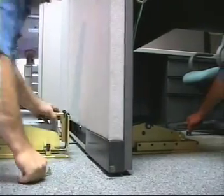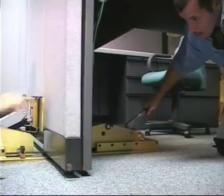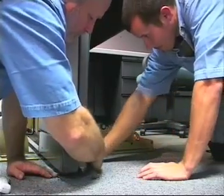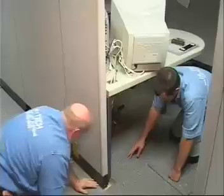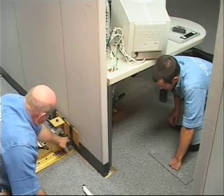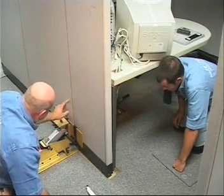We've got a desk on the inside and the wall on the outside, so we're going to lift the desk with one lift and the wall with the other lift and take our panel. There's our jack — here's our leg underneath it. We can jack it up a quarter to three-eighths of an inch and we don't have any problem damaging anything. We jack from underneath at the leg instead of going into the spline wall.